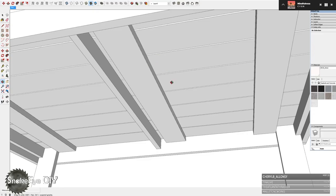So if I were building this top, I would line up all the slats how I want them on another surface, like a bench top or the floor, and then glue each of these, put them onto the slats as you have them prearranged, and then screw from the bottom up, assuming they're not going to go through. And that would hold it; the screws are essentially to hold the glue for it to dry properly. They don't have very much structural strength. This would also work if you were to do just screws, but screws really do not have a lot of structural support.